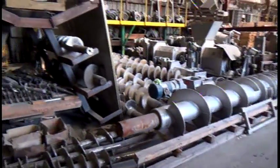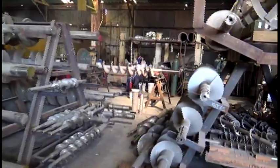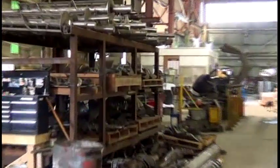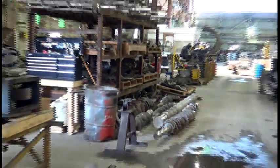A little more of the screw department. There's where they're welding them out. The white material is to keep the weld splatter from sticking, and they're welded out over there. We buy flights — sections of metal — which we weld onto the shaft to make these screws.